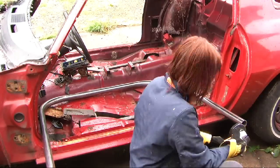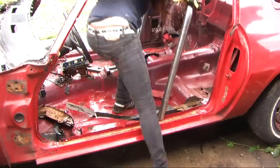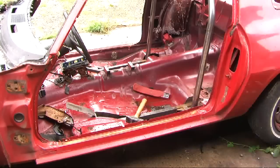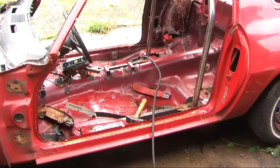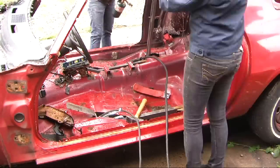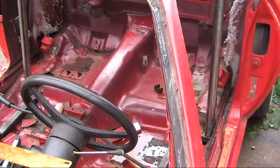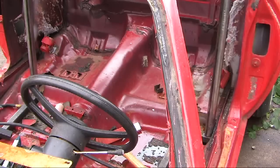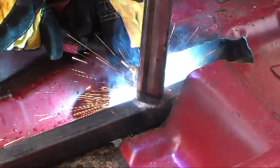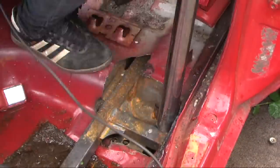There's the subframe connectors and the support piece that I put on there before. Now I'm angling the bottom of these tubes. The seat that Trish got is an aluminum seat with about 10 degrees tip back, so we're going to angle the roll bar back more or less to match the angle of the window posts anyway in the car. Here I had to get the giant crescent wrench out to try to tweak this into place.